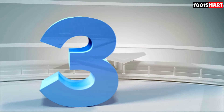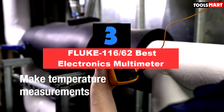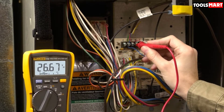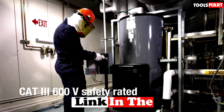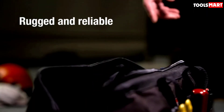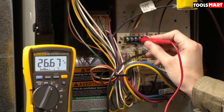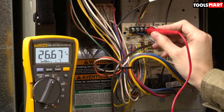The third product on our list is the Fluke 116, Best Electronics Multimeter. This Fluke multimeter is excellent at testing microamps — for example, in flame sensors we test microamps to check their sensitivity. It has a superb resolution of 0.1 µA. It comes with a kit including a digital multimeter, infrared thermometer, magnetic hanger, and a stylish carry bag. We were really surprised to see all these items at such a price. It's also a useful kit for HVAC technicians as they frequently need to check temperatures.